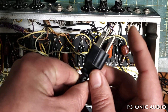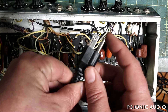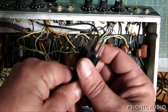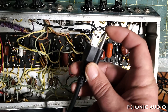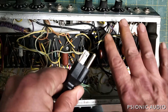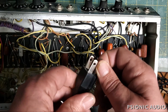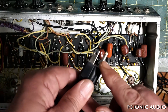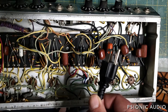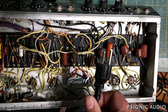So this amp will not electrocute you, so long as this pin is not removed. So many amps come in where people have broken off the AC safety ground prong of their plug. It's called the safety prong for a reason. Without this you are not protected. The amp is going to be noisy. You're going to be subject to electrocution. It's a stupid thing to do that too many people do because they don't understand what they're doing.